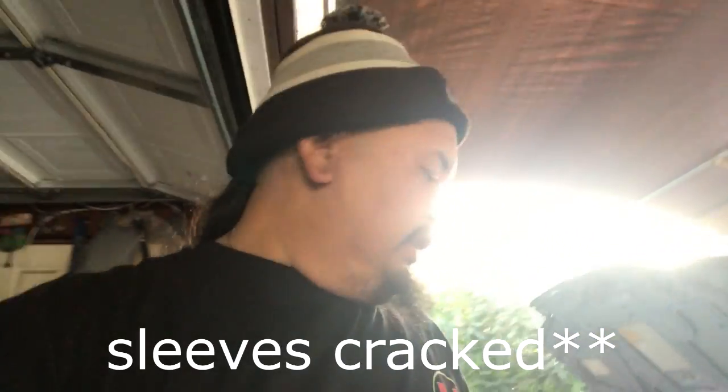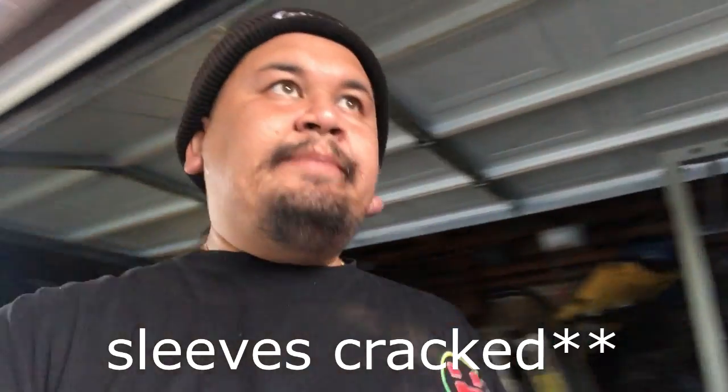So JDL contacted me, told me to send it out to them, and I did. They repaired it, and they did all four new runners, new flange and all of that. I received it back free of charge from them, but they told me that if anything happens after the re-weld that they did, I'd have to pay for it. And I guess that's just how it works. So the manifold was put into the CRX before I cracked it in 2015 and then pulled it back off. In 2015 it probably only had about 100 miles on it before it cracked. So now it's in this car with the new setup and probably only has about 200 miles on it. So we're at about 300 miles, and then there's a new crack right there on that runner, and that blows.